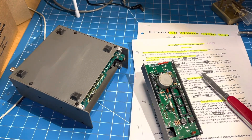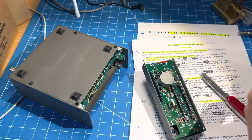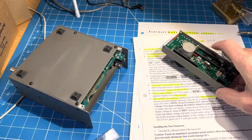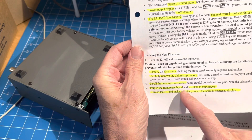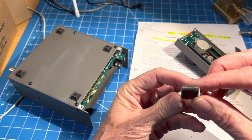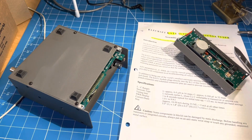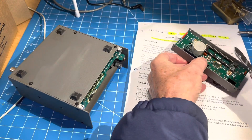So there's the front panel with no controller. Here's our upgrade kit — this is probably a 22-year-old rubber band on this. I've already read the instructions. Basically, it says remove the old processor and install the new one and put the board back on. So that's what we're doing. We will look at this processor and see how flat these chip legs are — I think we'll roll it on the table just a bit to get those flat so they'll drop into the socket. That's a little better.